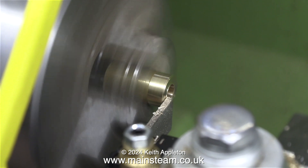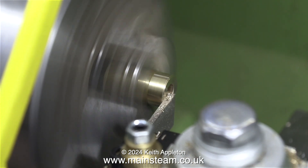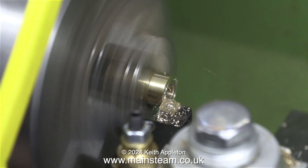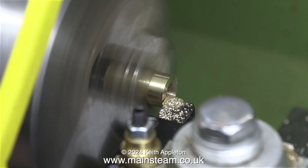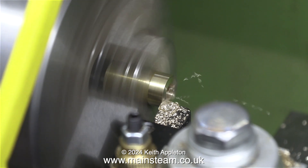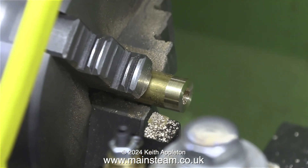Before I fitted it to the machine, I did two things to it. One was I machined and polished a bolt to hold it to the machine, because the original Allen cap head bolt that came with it really did look bad. And I also filled it internally with grease to stop the parts from wearing. And so far it's been okay — time will tell.